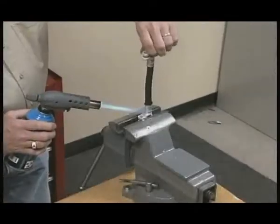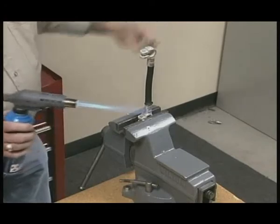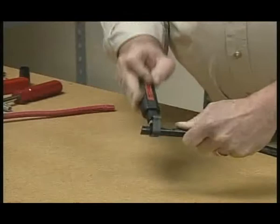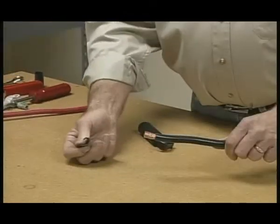There are four easy steps to guarantee a perfect bond with Fusion Connectors. First, clamp the connector, then strip the cable exposing about 7 eighths of an inch of the wire, depending on the connector you are using.